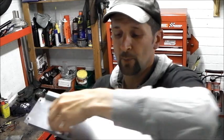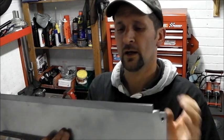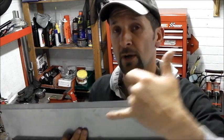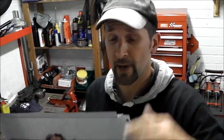Idea being that I bring this solid piece of metal sheet back as far as I can, not too cumbersome looking, trim it a bit. Bring it back as far as I can on the swing arm to get as close to the little mudguard assembly as possible, so that the rods that I'm going to use to curve and weld down onto this are as short as possible. The shorter they are, the less they're going to waggle about.